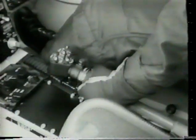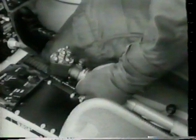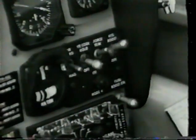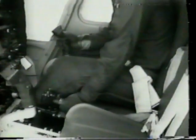The final check to be performed is the engine shutdown procedures. Roll throttle to idle stop and allow to idle for 2 minutes. Turn the force trim on. Now center the cyclic, push collective full down, and set friction on the cyclic and collective.